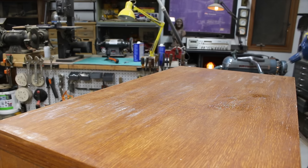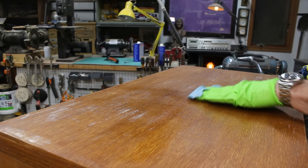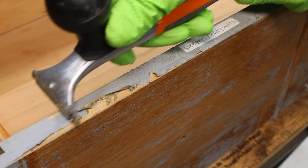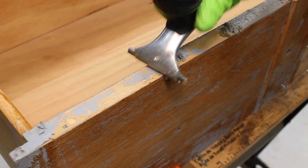As mentioned earlier, it's not necessary to remove all the paint prior to sanding. In this step, I'll apply water to the entire dresser. This should help raise the wood grain and make removing the paint from the wood fibers much easier while sanding. Once again, I'll use the carbide scraper to scrape some of the detailed areas of this dresser.